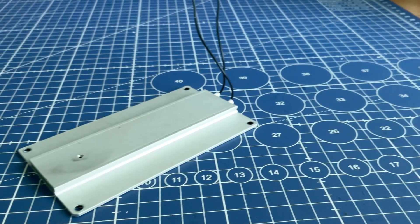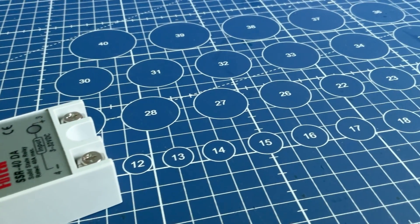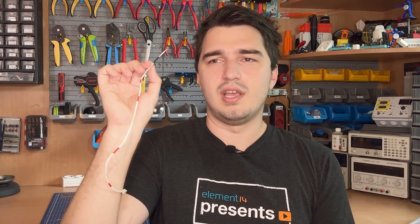In the center we have the hot plate, which is around 3 dollars, 400 watts, more than powerful enough. Because it works at 220 volts, we need to make sure to ground it, because if the heater goes bad and somehow shorts to the metal surface, we don't want to be touching that — or any of our PCBs. For controlling the hot plate we use a solid state relay. You can find them in various shapes and sizes. The main things to check: it can accept 3.3 volts from the Pico, is rated for 220 volts, and handles the appropriate current — at least 2 amps. For measuring temperature, we'll use an NTC thermistor.